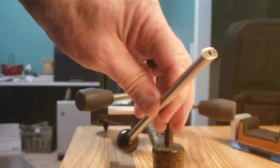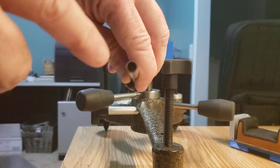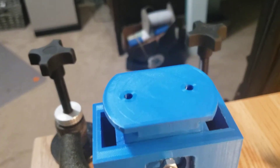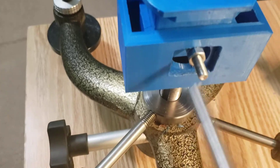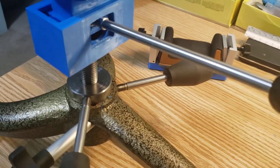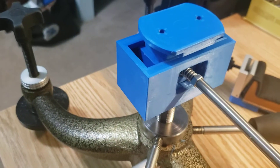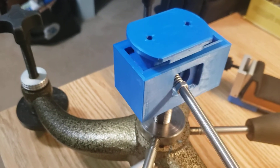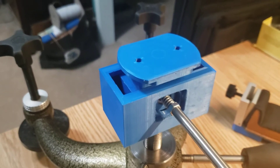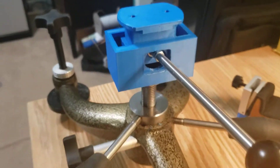I made a handle — it's 8mm diameter with a 6mm inside diameter, and I inserted a rare earth magnet in the end to hold it onto the screw. It just slides over the screw and is held in place by the rare earth magnet. So now we've got our joystick for sliding back and forth. The springs are not lined up correctly right now and not giving me full down travel — I have two springs, one inside each other, which isn't ideal, but it does give me enough preload to compensate for the weight of the gun.